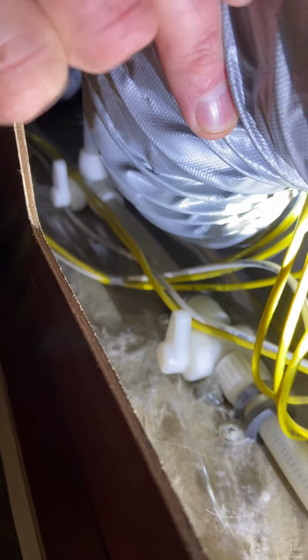Okay, you see that valve pointed up, and there's another one back there also pointed up. Basically, we're just going to push them down so that they're pointing towards the back of the vehicle, in line, pointing down. See if I can get that other one. And immediately what you hear, because the water pump is on, is water being sent to the hot water heater. See, the valve is now pointing backwards, so is this one. And no antifreeze in there, so it's a good thing.